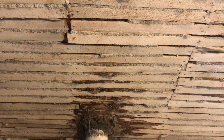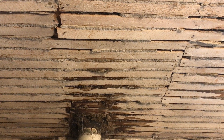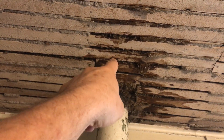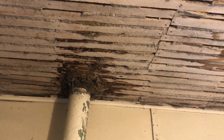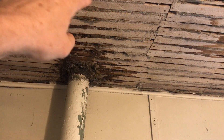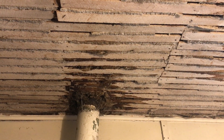Later on we'll be redoing the ceiling anyway, so we'll be able to fix this over. Let's start cutting it out. We need to see where the rafters are and cut right next to them on both sides, and then we'll have a hole big enough to go through. I want to do it this way from the pipe because the roof goes down that way, so I have more headroom over here — that's my logic.